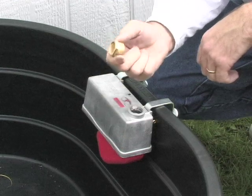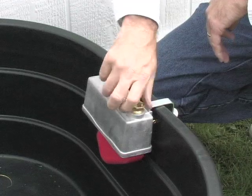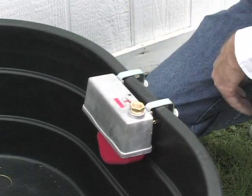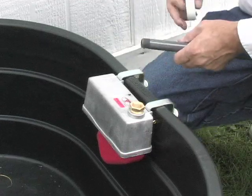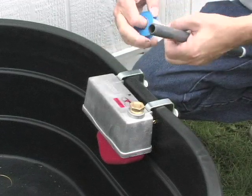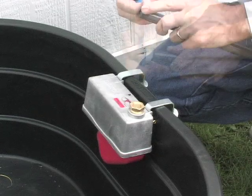An alternative, more permanent water supply line may also be used for all models of the Little Giant Trof-O-Matic by using a direct pipe plumbing installation. Simply attach the 3/4 inch adapter to the Trof-O-Matic, then attach the direct pipe installation. For a more secure seal, apply Teflon tape to the pipe before installing it on the 3/4 inch adapter.